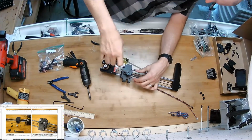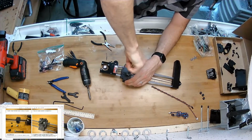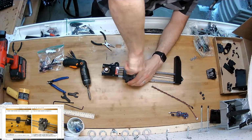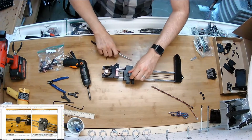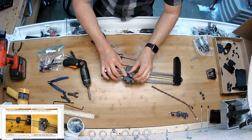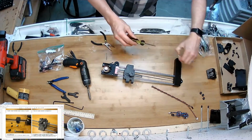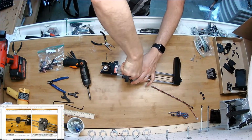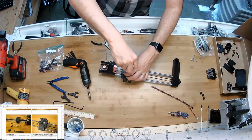Metal into plastic, but there's going to end up being about 20 threads engaged, and this one is not frequently torqued down too hard. So I think it's a good connection. There we go. Excellent. Well, there. Excellent. Good enough, because it's something you're just going to be doing that on. Anyway, next is a regular screw that just goes down, and we're not going to tighten that permanently. It's going to be left up high enough that you could slide this. It's just to constrain.